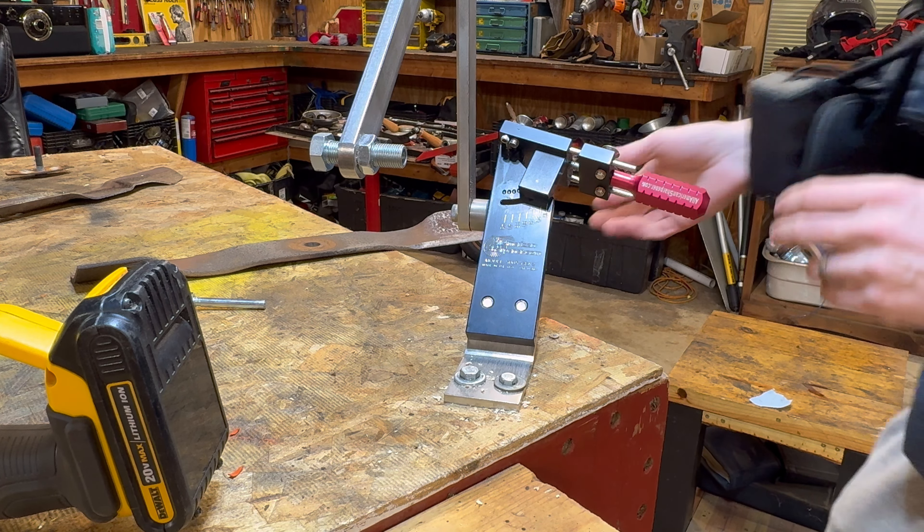When you're mounting it, as you see here I've mounted it straight to the table. Remember you're gonna be standing back here — going up and down — so mount it at a corner or edge of a bench so that the arm can come down. Also, your mower blade is going to be hanging down, so don't just mount it in the middle of the table. You can put it in a vise, mount it straight to a trailer — just mount it somewhere sturdy because we're gonna be using some serious power tools.